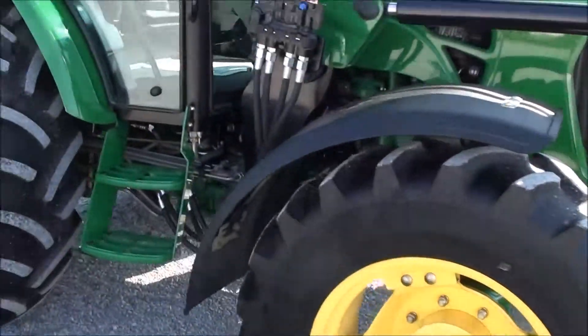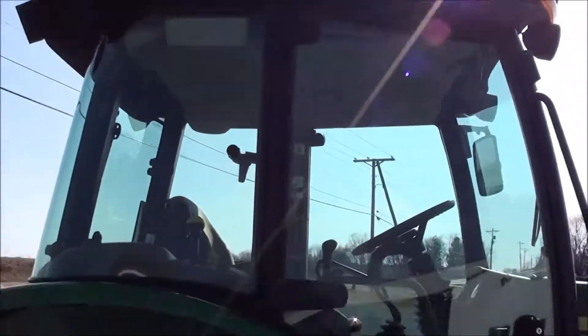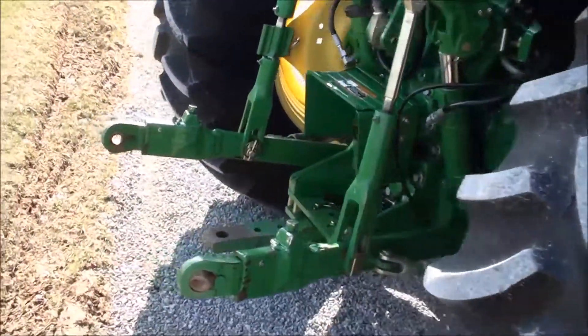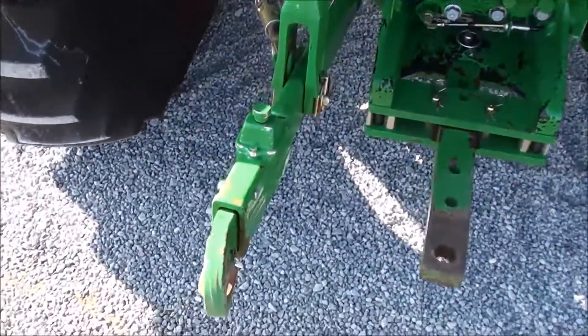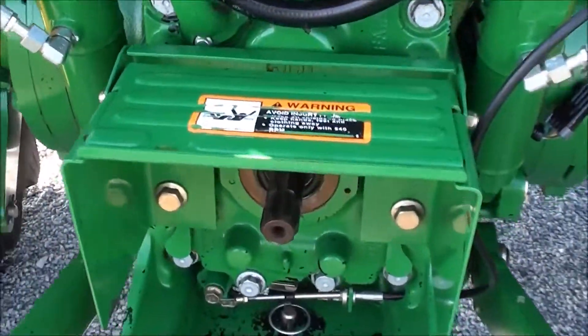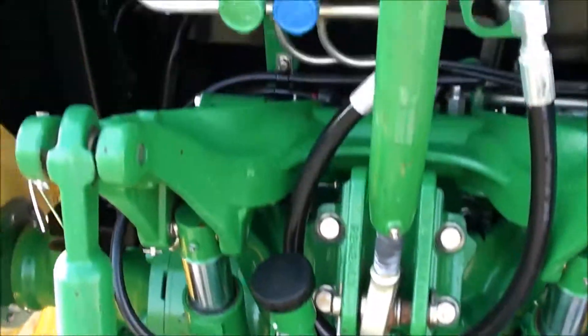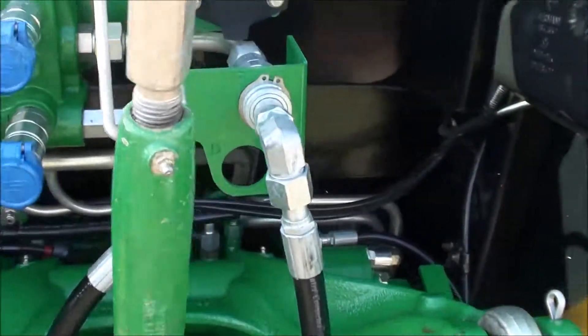For those looking for a clean pre-emission 100 horsepower tractor, this is a really nice fit. This is the M series tractor, so it's the heavier version of the John Deere 5 series. It has heavier three-point arms, heavier rear axle, also has 540 and 1000 PTO. It has dual rear hydraulics and also has the Power Beyond hookup.